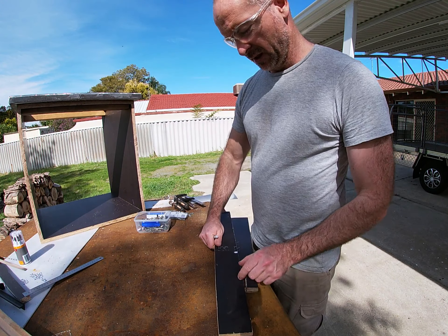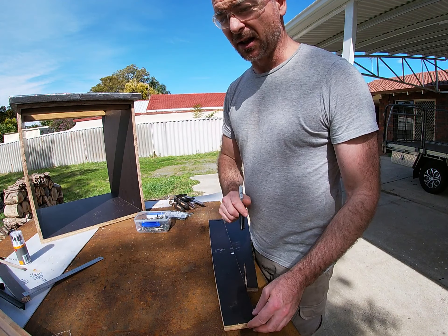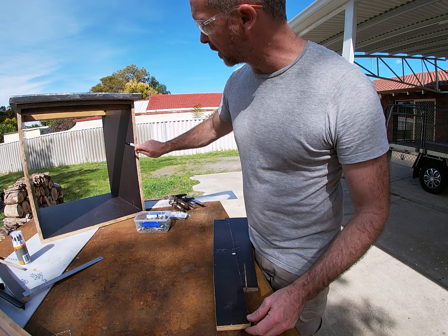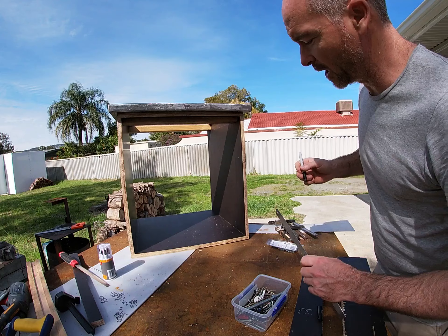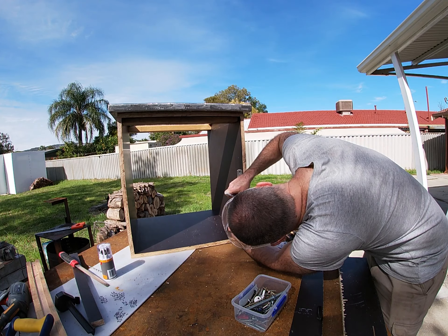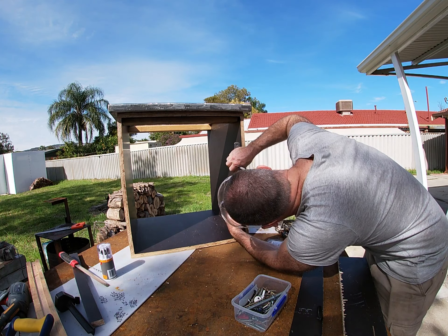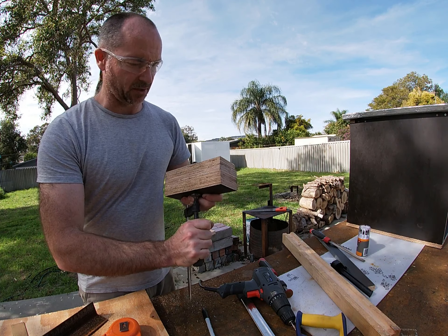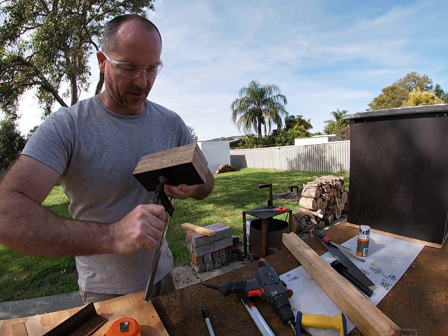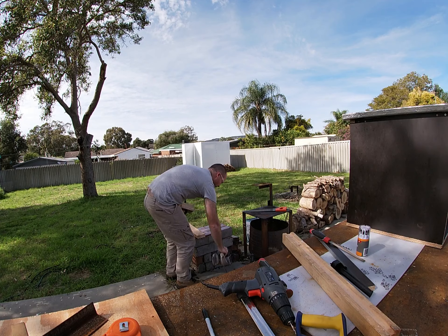You'll notice there's a tiny little gap down both sides, but there is going to be an extra rail down the sides there that the shelves will sit on, so that's not a concern. So the next piece is going to be cut out of this — it's going to be two bits at 530: 530 by 530 squares will make the shelves. So I need 1060 plus the cut width. Maybe I'll be able to cut it all out of this end and miss this dodgy corner.